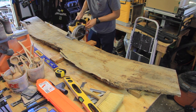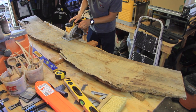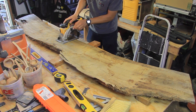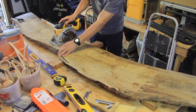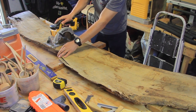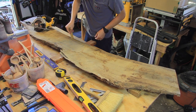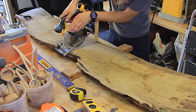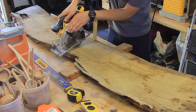Since I'd be coming back to cut the 45-degree angles with my miter saw, I went ahead and freehand cut the line with my circular saw — I didn't use a straight edge and it was fine. The piece of oak started to clamp down onto the saw blade and began to pinch it, so I used a wedge — or I guess it might actually be called a shim — on one side of the cut to help finish it out.